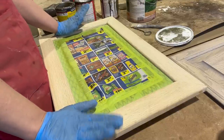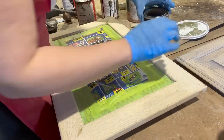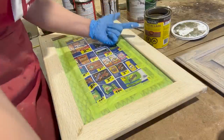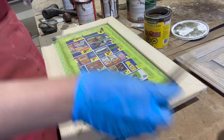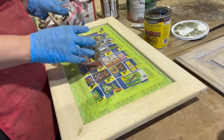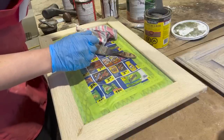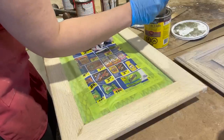So the very first thing we want to do is use a very light stain, which is mostly a wood conditioner, which I told you before, the Minwax stuff is basically just 95% solvent, usually not lacquer thinner, but paint thinner, mineral spirits base. So it's not going to sink into the wood. It's not going to make it super dark, which for people who don't really know how to prep wood really well, that's why these stains are so popular, because they're a little easier to use. They don't blotch as much as other stains do that have a lot of colorant.